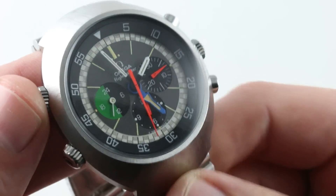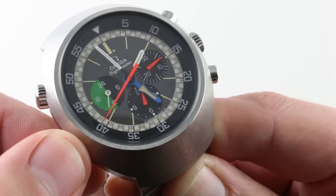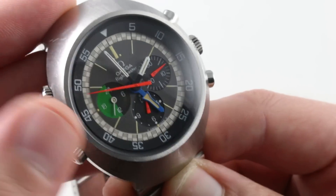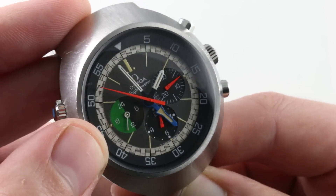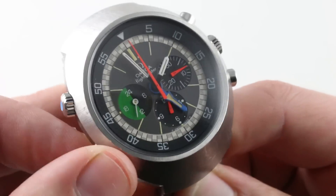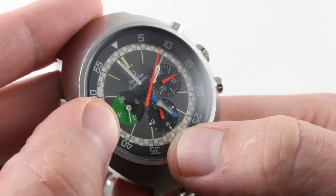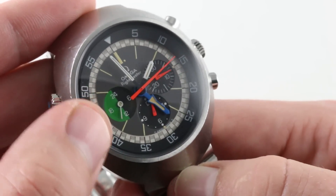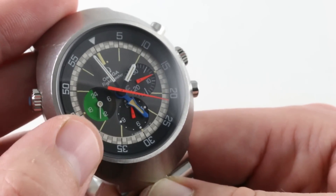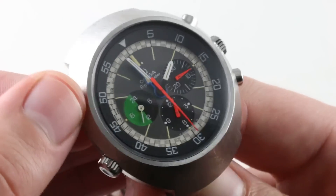The timepiece features a comprehensive dial, so let's take a tour of its multiple hands and gauges. First things first: bi-directional rotating internal bezel, aviator style. The watch was originally water resistant to six ATM with a unique flush-fit seated and sealed crystal, but these watches are getting too old to test at the upper limits of their performance envelope — I recommend you not experience explosive decompression in this watch or 60 meters of water. Inboard of that bezel there are three registers: chronograph seconds, chronograph minutes, chronograph hours up to 12. There's also a 24-hour indicator keyed to the local hour hand at center, so that indicator lets you see whether we're looking at 2 p.m. or 2 a.m. — and as you can see we're approaching 2 a.m. because of the a.m./p.m. indicator.